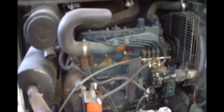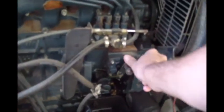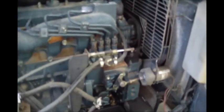Will it start? Nope. One aggravation of this little excavator, it's got an electrical gremlin. We tried to solve it. Turn the key on, nothing happens. Doesn't kick the injection pump shut-off cylinder solenoid on. Aggravating, have to get back there and do that every time.